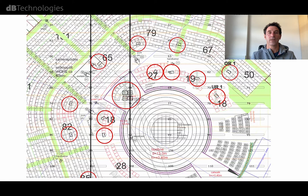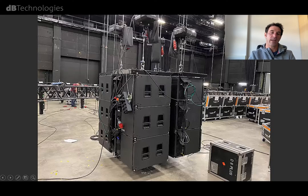It had to be very compact but very powerful, like on a rock and roll stage. So we decided to put them into one big source, three deep only, but four positions. It's a very special design because you can see these four positions here, three pieces per position, are done in a circle. So the front is going to the side, front is going to the side, front is going to the side, front is going to the side. This has the effect that we have the same distance between every bass speaker, and we have one really big omnidirectional source in that case.